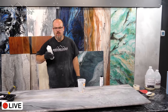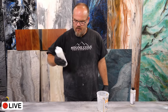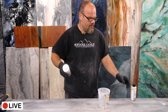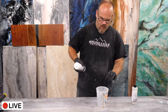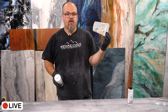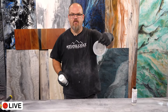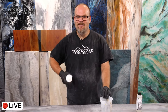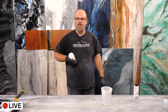Shake part A — it has a matting agent that knocks the sheen level down, so shake before you bake. Part A is the resin, part B is the hardener, two-to-one ratio. I have an old cup here — we're out of mixing containers — so I cleaned it out. I'm on day two of no caffeine and juicing, so my brain isn't firing on all cylinders.